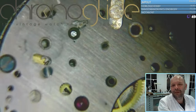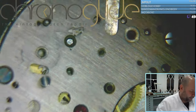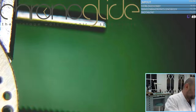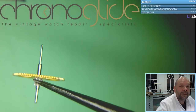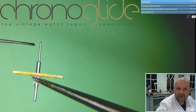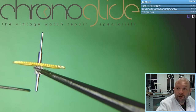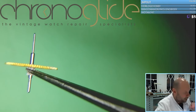If we remove this huge plate, then we will see the actual movement underneath — the gear train. Not too much wear, and again the pivot is in good shape. Here is a special wheel because this side is the pivot for the second hand, which is always moving — not for the chronograph but just for telling the time. And this is the extra thick and long pivot for the power source for the chronograph. Remember when I pulled off the extra wheel with the presto tool — there was this pivot here.